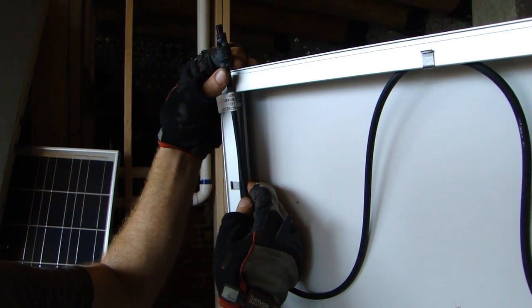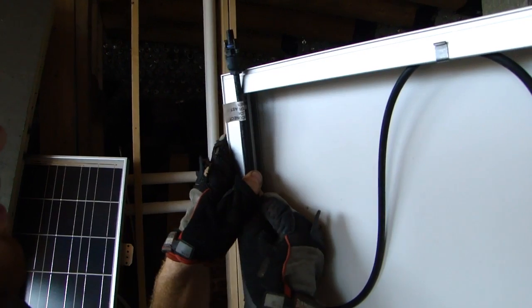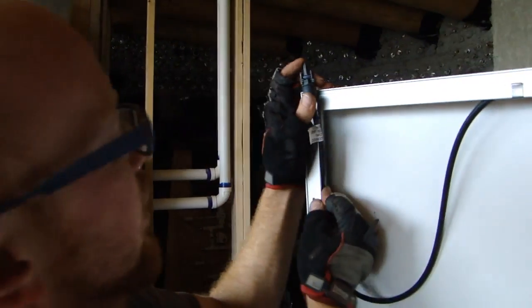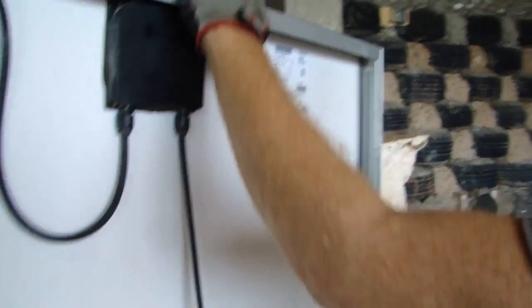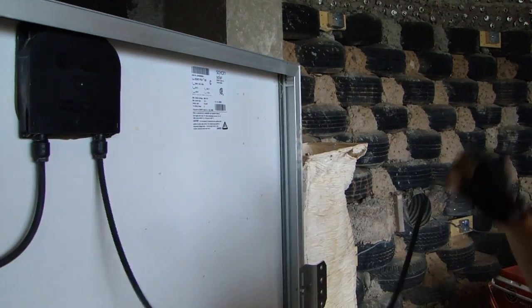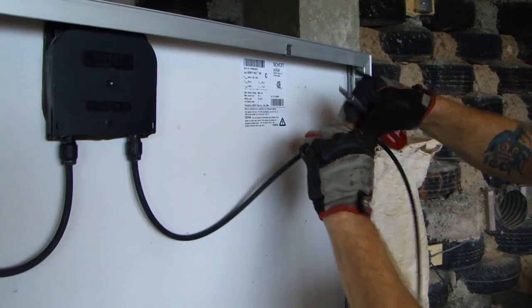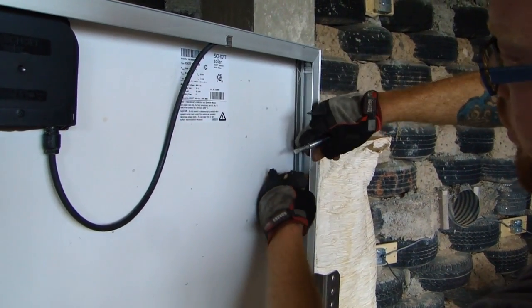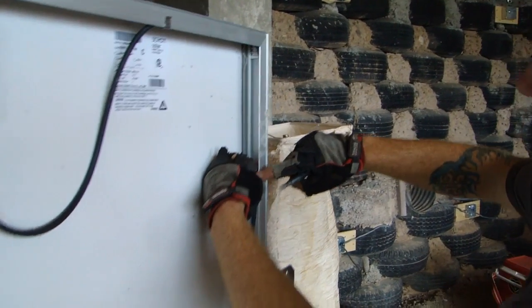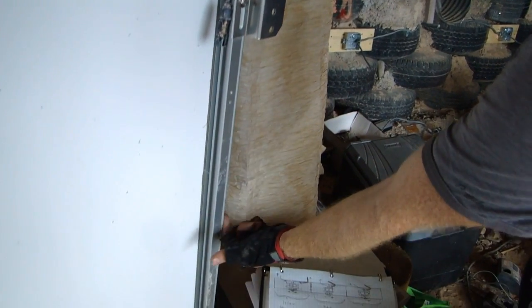You just want to leave a little bit sticking out. There's going to be an inch between the modules, and we don't want this to spring like that. You can always adjust it a little bit when you connect them, but about that should get us there. That way it'll end up something like that, and you won't see these because they'll be under the module. And then on this side we'll do something similar, but this is going to be a home run — it's not connecting to another module. This is going to the box, connecting to a lead that will go into the box. We'll put this one about the same place, putting a little back twist on this to keep it tucked up into the module, and I'm going to clip it a little lower on the side. So this one is going to connect to the home run and come out a little bit, then follow up the module into the box.